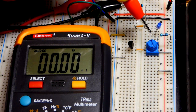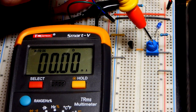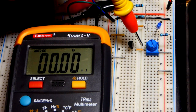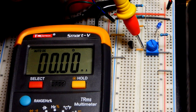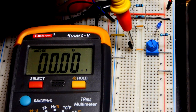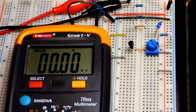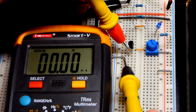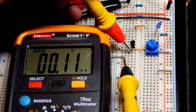It comes to the trim pot. There's a resistive element there and a wiper. A wiper connects there. We can slide it across that resistive element. And so the middle pin underneath there comes to this jumper, and we put it to the base of the transistor. And we can see how much current that's going to put through the emitter to ground right there.